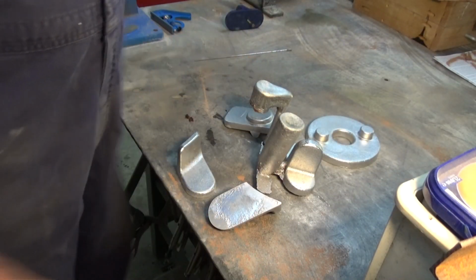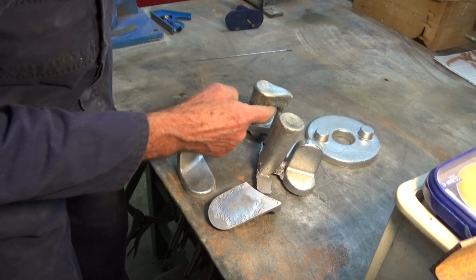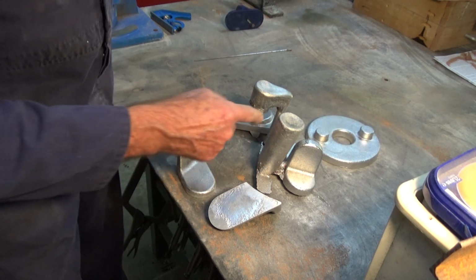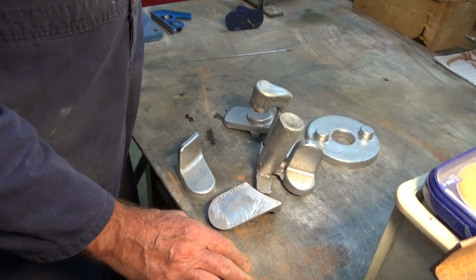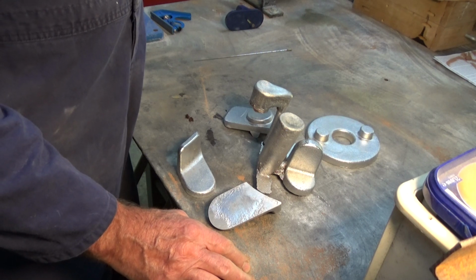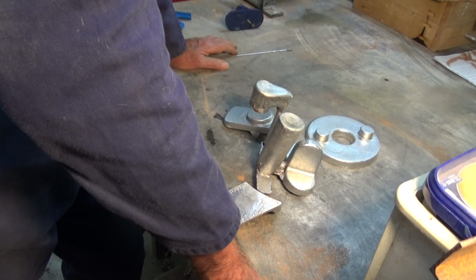And hang on, who's that? Hey, it's Olfoundryman. How are you, mate? No, I did that. Yeah, I left a 10mm high ridge between the basin and the sprue. No, I did that too. I rounded it off where it went into the sprue. What? No, I did not bury a dead cat under an aluminium tree at midnight. No, sorry. Okay, I'll try better next time. Okay, see ya. Where am I going to get a dead cat at this time of the day?